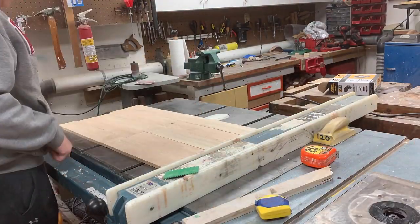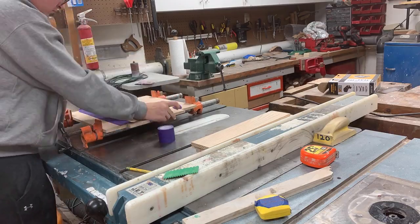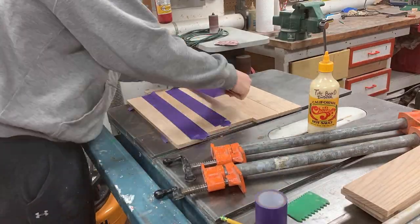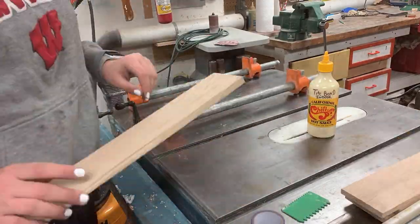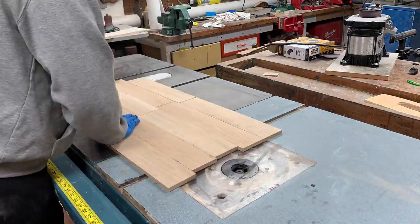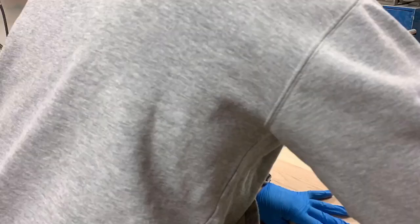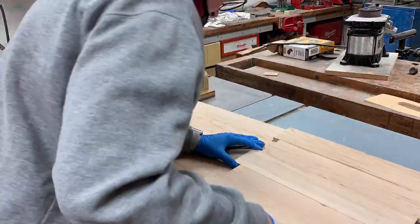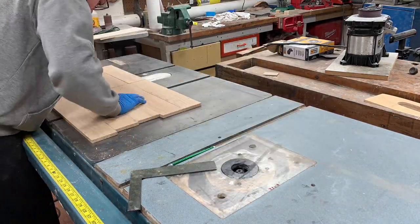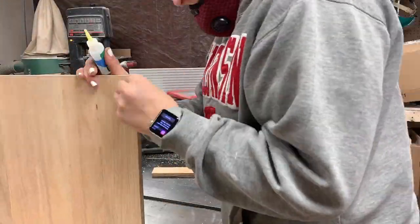As you can see here, I'm lining things up and making sure everything will be straight once I glue it. They fit together like a little puzzle, but I will later cut that off because it just doesn't work. This is how I glue up my panels — these thin board panels. It just makes it a lot easier and I just use tape. I do it to both sides, then take off the glue and sand everything down. It didn't fit very well, so I eventually used the crosscut sled and just cut them. You shouldn't do this because in the long run when I went to use this board, it actually broke.